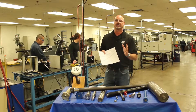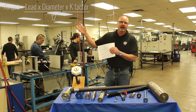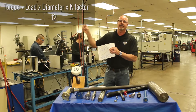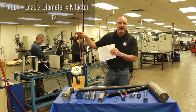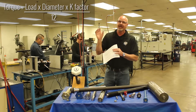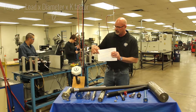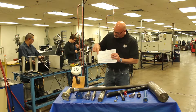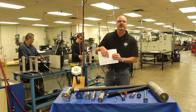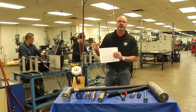If you go and install something to torque, what's that mean? You've got your torque simple formula where load times bolt diameter times friction divided by 12 equals foot pounds of torque. We take away that equation by installing your load. We know that you need 40,000 pounds of load — you come over to this fastener and say, 'I need 57% or 47%' depending on what grade and style of bolt you want.